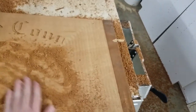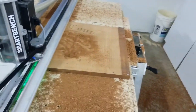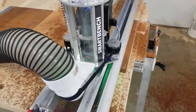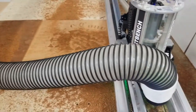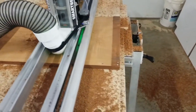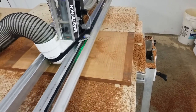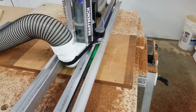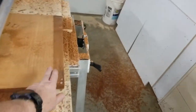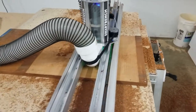Because of how I had cut it before, I want to take this all the way down until the previous marks are gone. If I had kept the origin location I could have just recut the top after surfacing, but I'll just take it down to a thinner plaque. It's just some mahogany I had in the shop — an inch and an eighth thick. I've programmed two passes, but if I need another one I'll touch off here, let it make one pass, and stop it before the second pass.